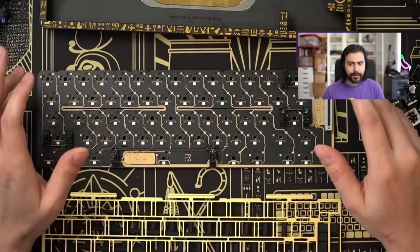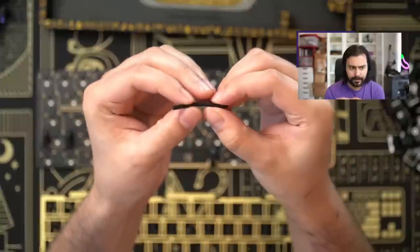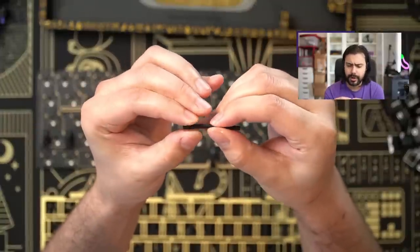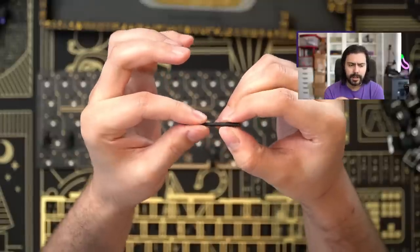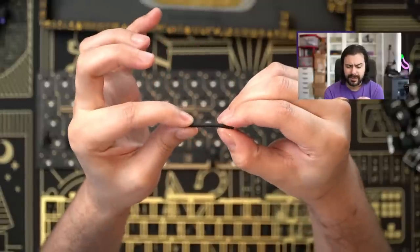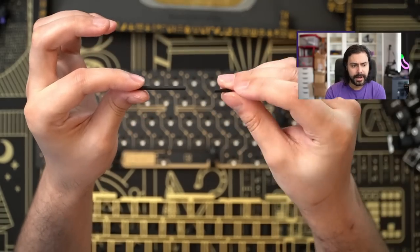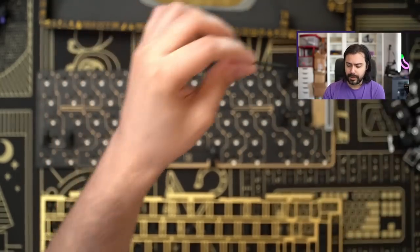Now, the mounting force seems pretty hard, okay? Now, these gaskets themselves, these hot dogs are hard, dude. These are hard. I don't have a durometer, like a hardness tester, but these feel like 78 to 80A. They're tough, dude. These are very tough. And keep in mind that essentially you have 80A under and 80A on top as well. So